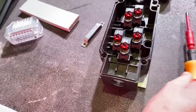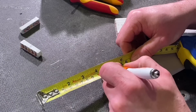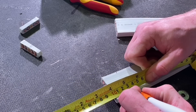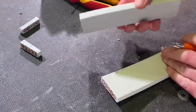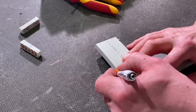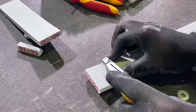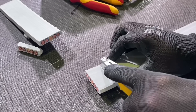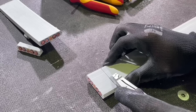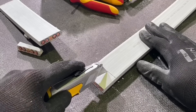To fit the end piece, I'm going to mark 19mm in from the end of the cable and mark all the way around. There is a specialist tool available if you're fitting a lot of the system, but we didn't get that — so I'll use a knife. Press quite firmly in order to cut into the cable. The outer sheath is quite tough and it's LSOH, so there are no problems with fumes in a fire situation. Then cut down and peel the sheath away — it's very easy to peel once you get it going.